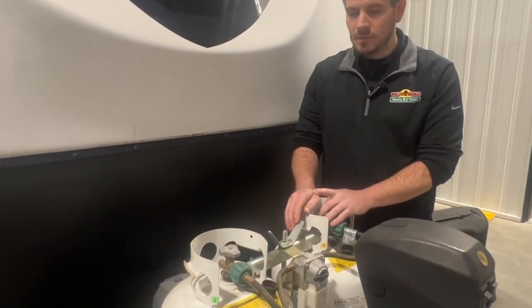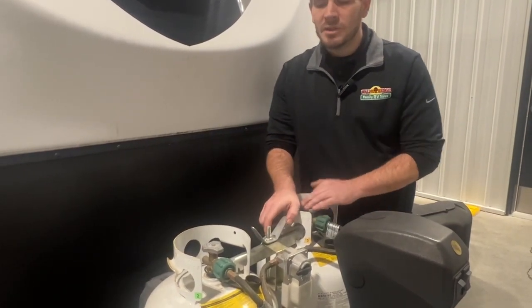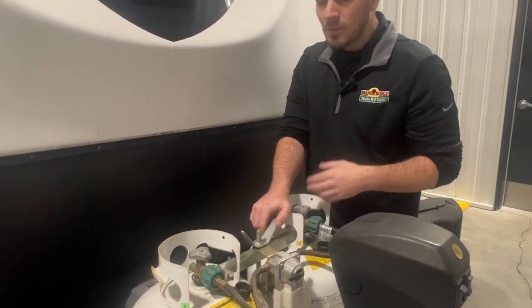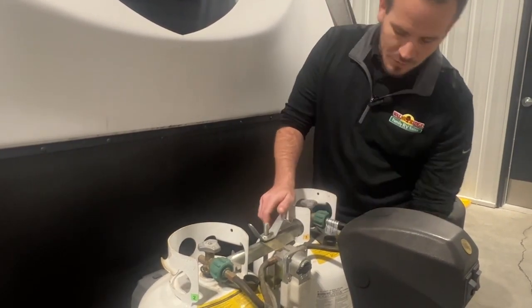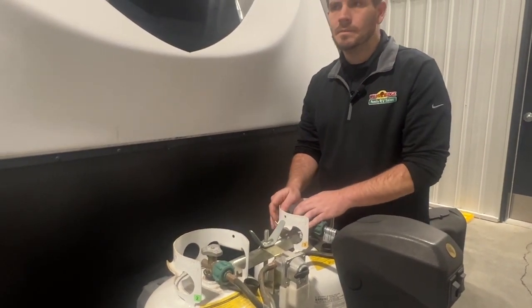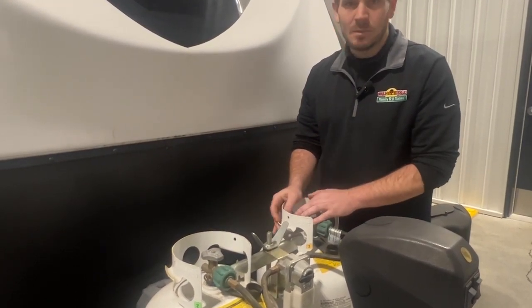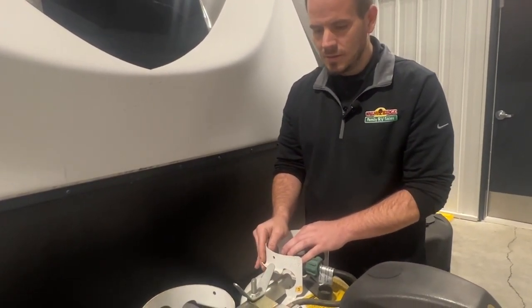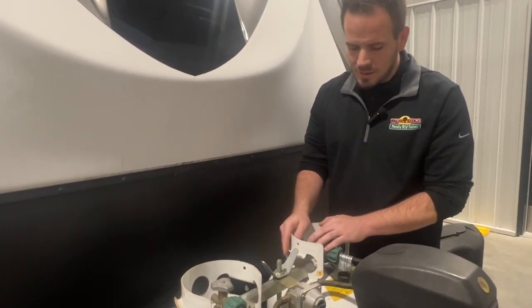There's a 10-year limit essentially on the tanks before they need to be recertified. We check for dents and make sure that if there are any small dents, they're under a certain parameter, so that we can legally fill the tank safely. We check and make sure that there's not rust that's going to cause damage. And when you get the ones from exchange places, a lot of times they do check them out fairly well, but there are some bad ones out there that I've seen, that they don't particularly check to the specifications that they should be. So if you can, have them filled.